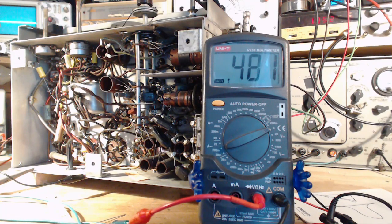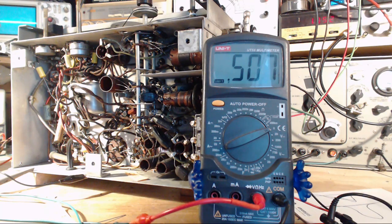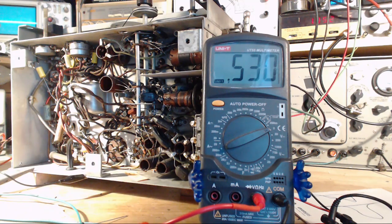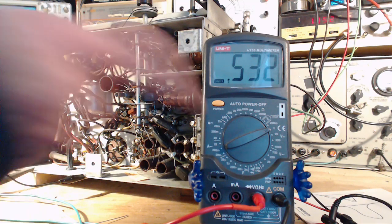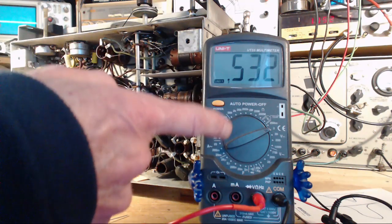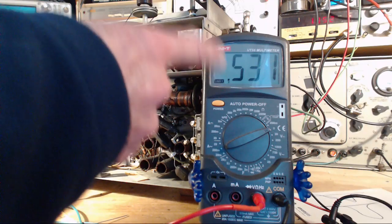Going up. Anybody want to try to explain that? Half a volt. Oh, I'm glad I did this, because I've demonstrated this effect a few times, and sometimes this demonstration doesn't go all that well. So I'm suggesting that this is a half a volt battery that can produce enough current, enough power to drive my meter, because the meter takes almost nothing. It takes something. Almost nothing. If we disconnect the meter, this voltage would go up even higher.